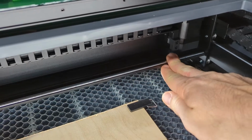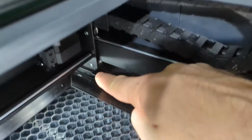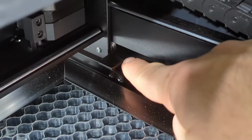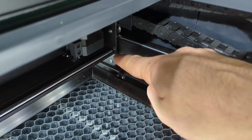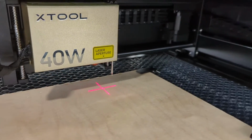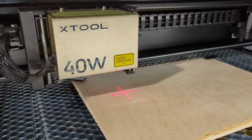And there's a reference surface way in the back here. There we go. So way back here, there's a little reference surface that's going to do the math and see the difference between this reference surface and here. And you can't see with the contrast, but even this part, you can see it a little bit there. We got like a little mini gusset. So this thing is nice and solid. You need to have your reference point stable. So here it is in action. I hit the button. Goes over to the reference point. It just did the math and you're autofocused.